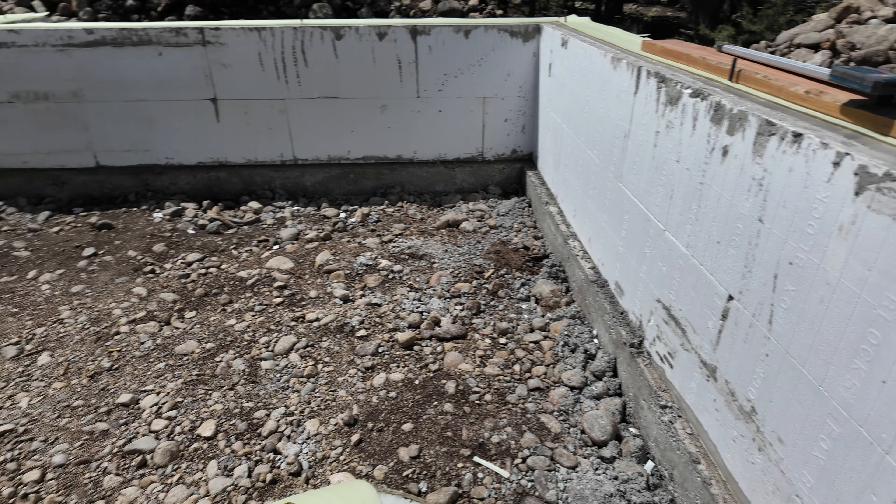So a little change of plan — that'll be tomorrow. Today we can get going on taking out our two-by-twelves and starting with the center girder that's going to hold up the house. We'll put three in here, all sandwiched together, and run the girder down the middle. We have these six-by-six posts for the middle supports. We've got the laser set up on the corner with our receiver over here to make sure this is going to be a super flat floor. The plan is to get our two-by-twelves set up and start building the center girder.